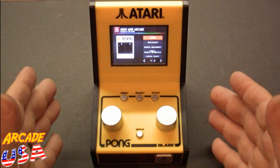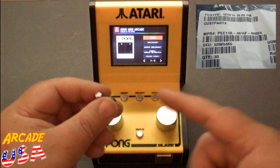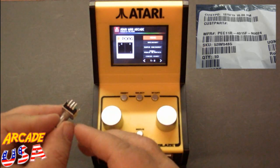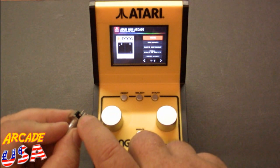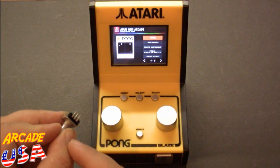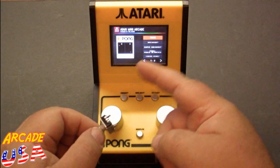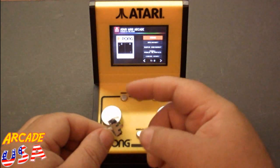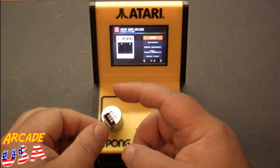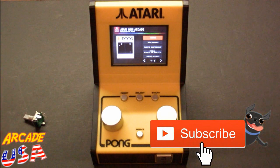That's the modification. If you have one of these, the encoders cost about two bucks each — I got mine from Newark Electronics and I'll put the part number in the description below. The wiring is really easy: the center tab is the common, so the C wire with the red stripe goes there, then A and B go on each side. If you hook A and B up backwards, the paddle will go the wrong way — just flip the wires. I recommend testing before putting it all back together to make sure the A and B channels are correctly hooked up. Anyway, thanks for watching.